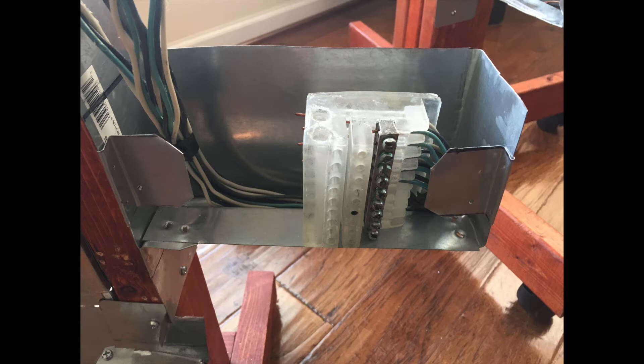Once the wires are attached to the hub, the hub and the wiring harness are dropped into the box, placing the top cover on top of the junction box. The top cover is then fastened — this can be done in many ways. The cover can be snapped into place, snap-locked by itself, snap-locked with one or two vertical screws, or have a door connected by a hinge. PVC boxes can have the plastic thinned out for a hinge, or PVC and metal boxes can have a simple cover made similar to a battery-operated toy, where one side gets hooked and the other side gets attached. There are many ways to attach the top cover to make a strong, non-flexing box.